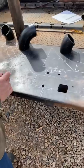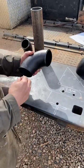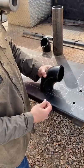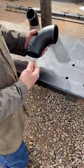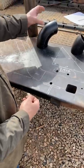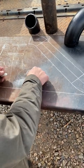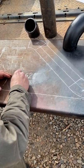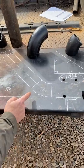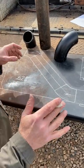Another way to do it: if I lay this out on my CAD system, on a long-radius standard elbow the distance from the surface to centerline is one and a half times the nominal pipe size — so 3-inch would be four and a half, 4-inch would be six inches, and so forth. When I calculate the takeoff it comes out to 0.621, which is really close to 0.625, which is 5/8. So 5/8 times the nominal pipe size will give you your takeoff on most things.